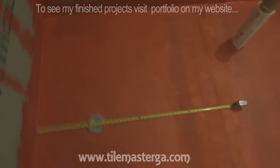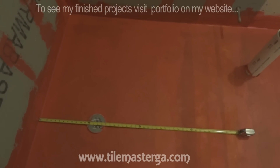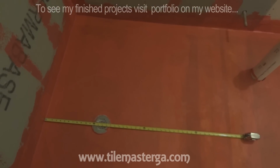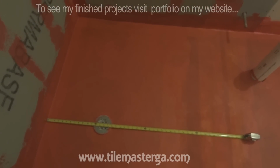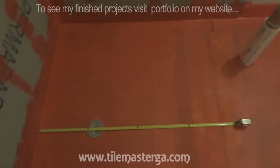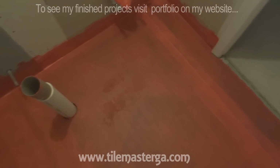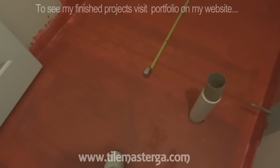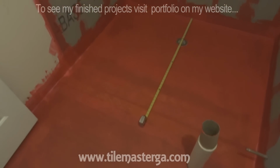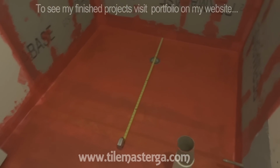I will start from the floor, so we have this surface covered, so there's no chance for Red Guard to get damaged at any point when installing wall tiles. So I'll be starting from the shower pan floor and then the main floor. Not too many tiles to put in, but as you've seen, it's a tight space, and we have to make sure that we do the maximum.